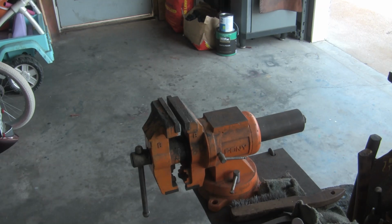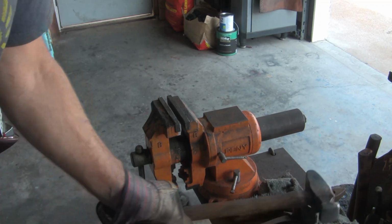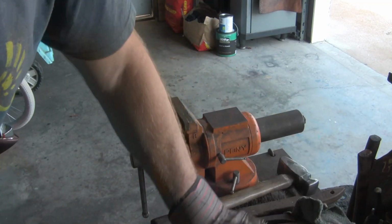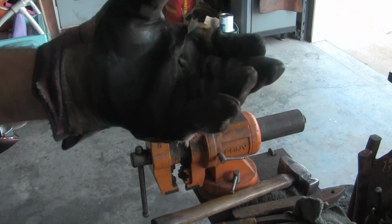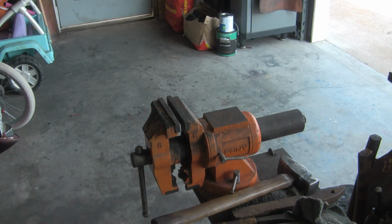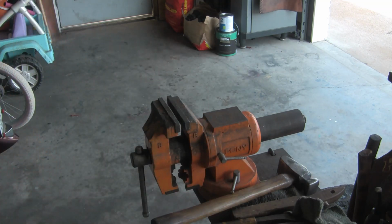Now the inside of the buckle needs to accommodate a 3.5-inch belt, so I've got to make sure I get this bend correct. The first bend, the short one, was at 1 3/4, so I've got to do 1 3/4, then 3.5, and then hopefully have a successful forge weld.